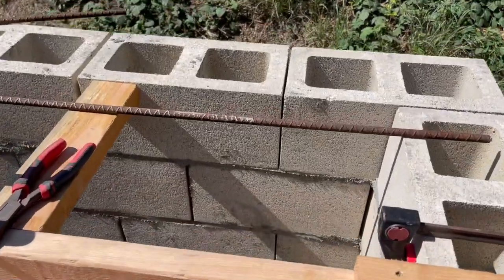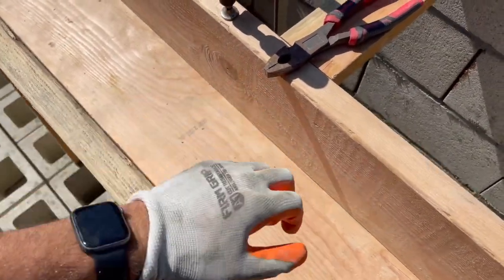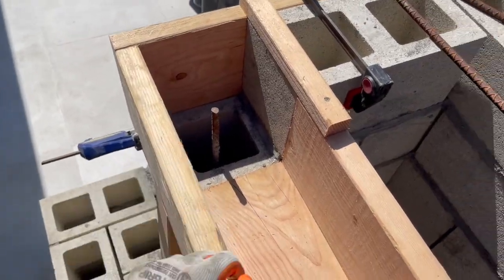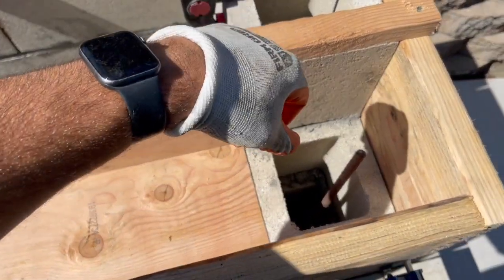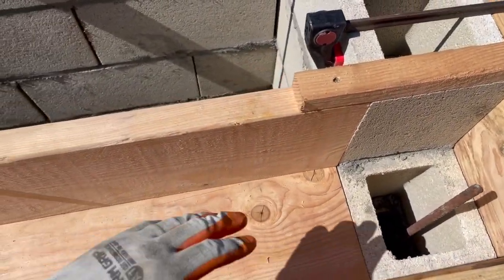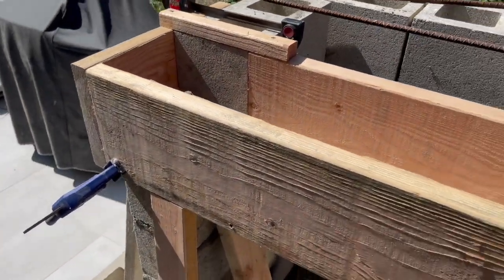Got our piece of rebar cut that we're gonna drop in this form once we're halfway filled. Got our rebar already inside our channels like you saw. We're gonna start by pouring buckets of concrete in there, slowly fill it up. We'll see how many bags it takes.